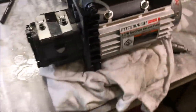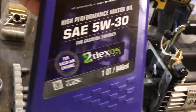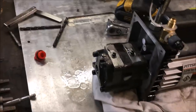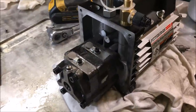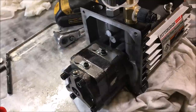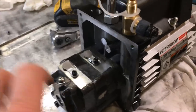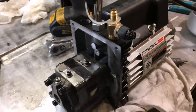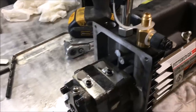I really need to stop running this without oil because it's tearing itself apart. I'm going to put some Royal Purple in this thing just because I know what it can do for parts. For the most part this thing is going to need an oil vapor filter. A commenter on my other vacuum pump video mentioned that all vacuum pumps discharge oil mist — some have a filter for it. I was under the impression this pump was damaged because of so much oil vapor, but it turns out it just doesn't have a discharge filter, which it needs.